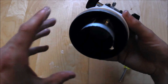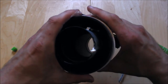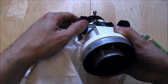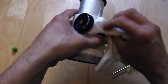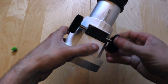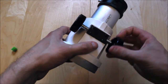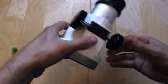Work the grease in between the component. One thing you've got to be careful of — when you put fresh grease, if you do get a lot of grease on there, just wipe off the excess using a dry rag. Remove some of the excess alongside the top part here, clean the base up itself, and around the focus wheel. Once at this point you can see already a massive improvement on the focuser — it's a lot more smoother. We're going to adjust the friction later, but what we're doing is working the grease in on the focus wheel.